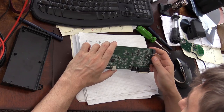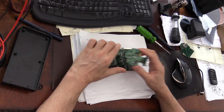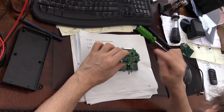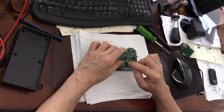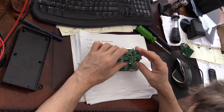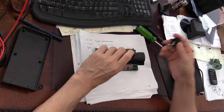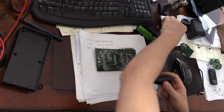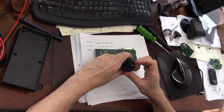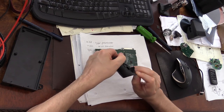and I believe there was another PIC microprocessor that I found in this board. And then also, if you look at this board, which is the transmitter for the eraser, this is a PIC. So they use this PIC microprocessor to generate the pulse signals. And I believe that, yes, this is the only PIC on this board. And I found another PIC inside this, if I take this pen apart.